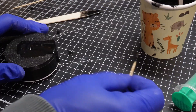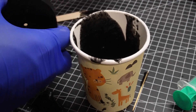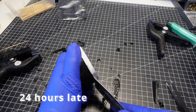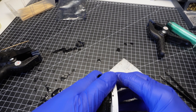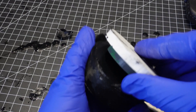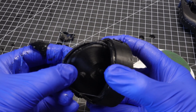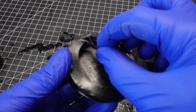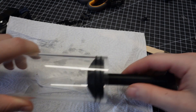My initial plan was to mix the silicone in a cup and then use a syringe to inject it into the mold, but because the carbon dust wasn't fine enough that method didn't work very well. So I ended up just pouring it directly into the mold, and in a panic I also drilled a few ventilation holes hoping that would help with the casting process. We have a big air bubble here, but other than that it looks quite good. Despite this messy approach I ended up with a usable cast, but as I feared the friction was too high.